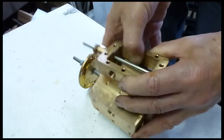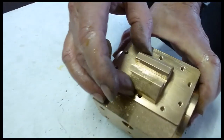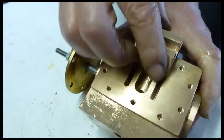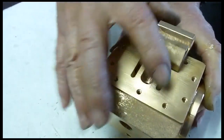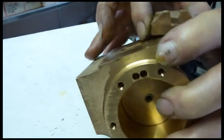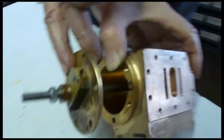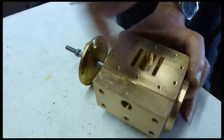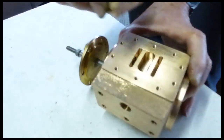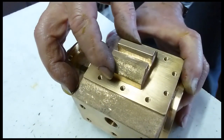What the valve is doing is at the moment covering the ports. You've got three ports under here — each one on the end is connected to the end of the cylinder, so those holes there are connected directly through to this port, and same again on the other end. Then the middle one is the exhaust port and that connects straight through into the exhaust system.